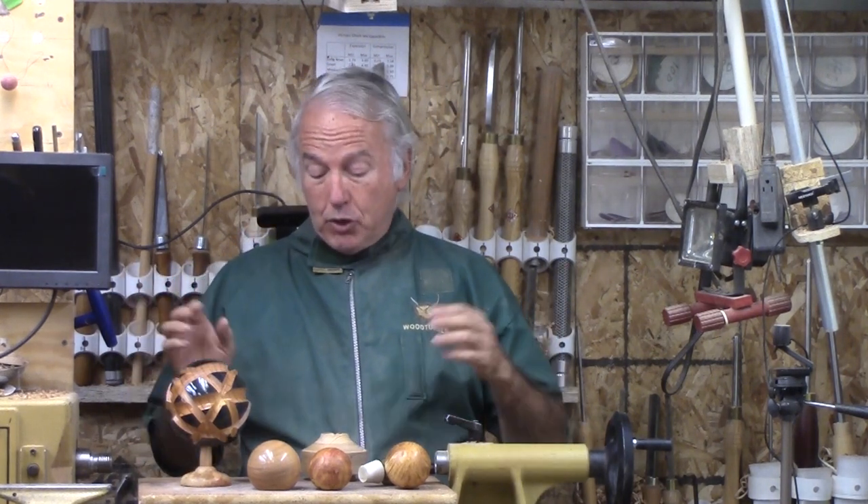This process is adaptable to anyone and without the expense of buying a jig. So let's turn perfect spheres out of plum with no specialized jig. Turning a sphere is easier done than said. I will explain the process two ways before doing any cutting. Let's begin with the end in mind. A sphere in two dimensions is a circle. A cylinder is a rectangle. Our lathe will rotate the two-dimensional figure into a three-dimensional object.